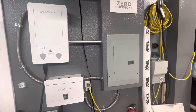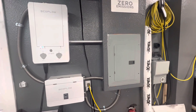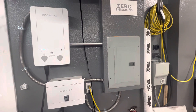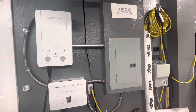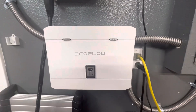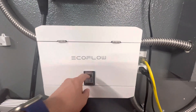In case you're looking to install the EcoFlow AFCI breaker box, here you go — I was able to get this to work. Unlike the regular smart home panel, what you're going to be doing is putting this AFCI box in line between the breaker and the smart home panel.